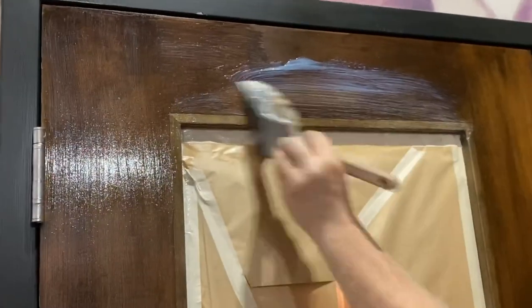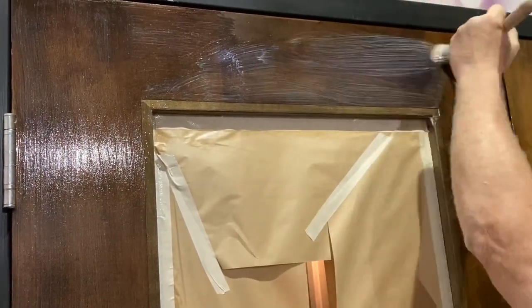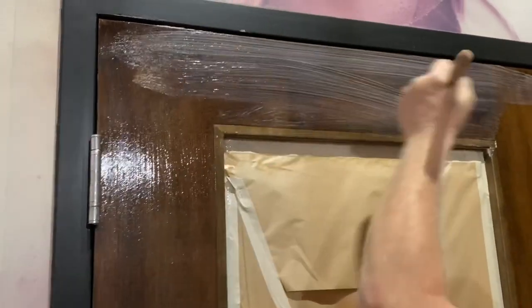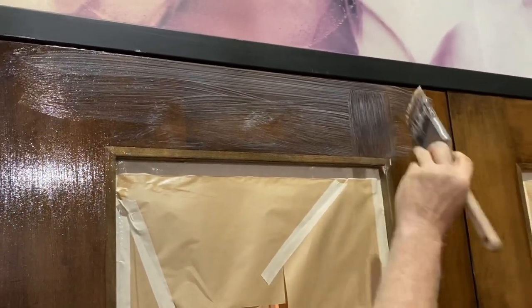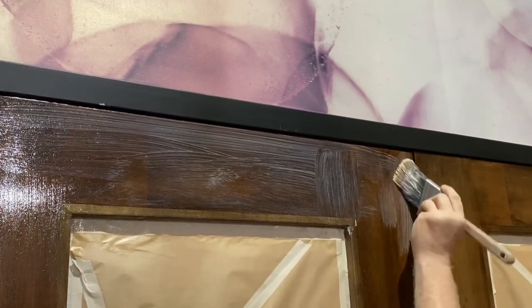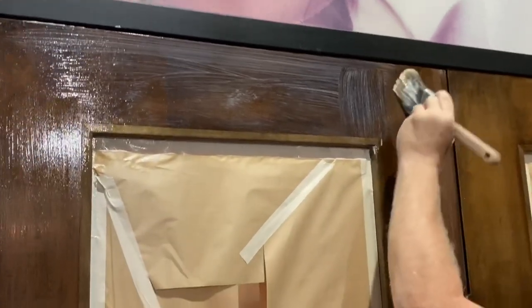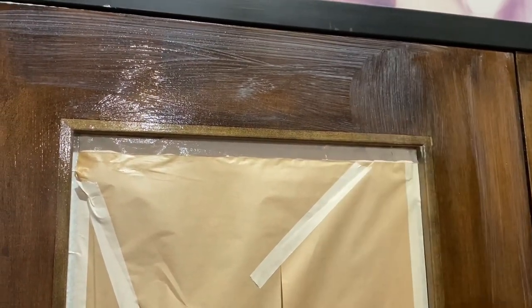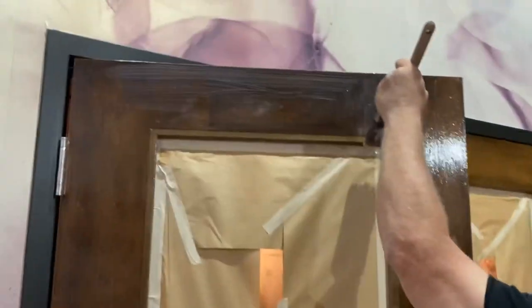What I'm doing in the video is applying the clear coat after that stain dried for two days. You don't have to let it dry two days, but I put on multiple layers of stain, so I highly recommend that the oil in the stain be permitted to dry a full 24 hours at least. Because what you're seeing me apply here is a water-based poly coat, and if there is any humidity coming out of the oil-based wood stain, you'll have bubbling or blistering of the clear coat on top. So please don't rush the project — take your time to do it right.